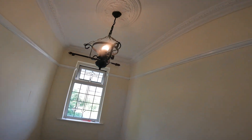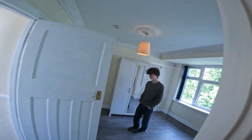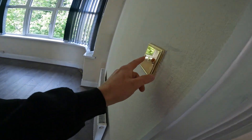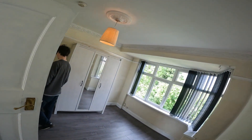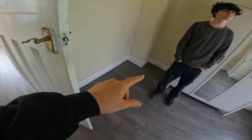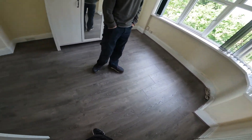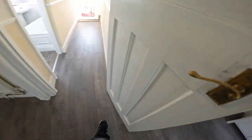We've got classic lights with the switch upside down. We need to check that all these switches are earthed. It's got a dimmer. And this socket's going to be an issue out there - I'm going to have to make a call on that one. I think we'd struggle extending that with all the floor being probably newly laid laminate. I still haven't found the fuse board yet.